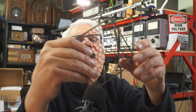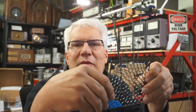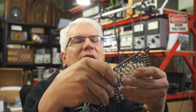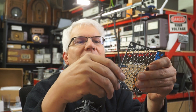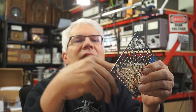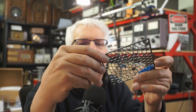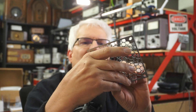So I decided to slow it way down. I took that same cut piece, same g-code file — everything's the same except I changed the actual cut speed down to 80 inches per minute. And because I'm running slower, I went ahead and turned down the power. So this particular cut is done at 80 inches per minute and 600 watts on 18-gauge cold rolled steel.